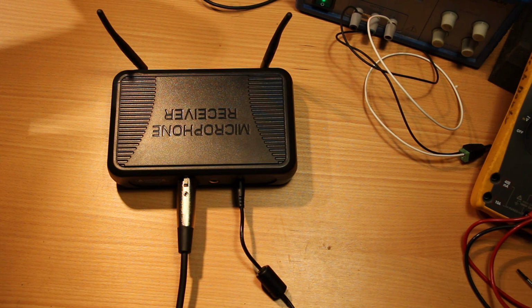To rule out another source of noise, I'm going to turn off the transmitter. And now I'm back. So that just results in a very, very tiny click. And then even with the transmitter off and the receiver not getting a carrier wave at all, you still hear pretty much the same hiss, which tells me that hiss isn't actually coming from the radio signal, most likely,